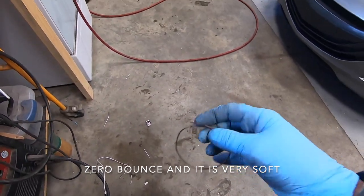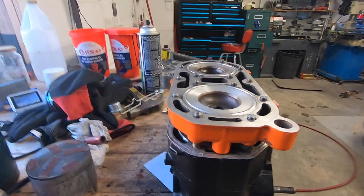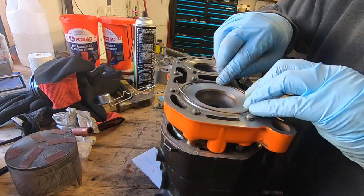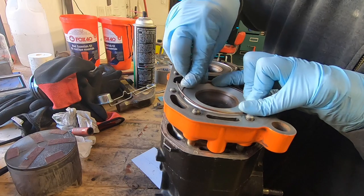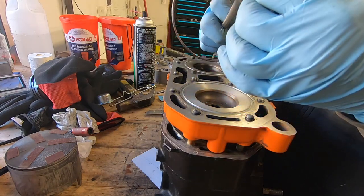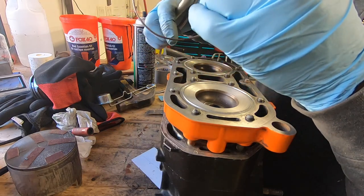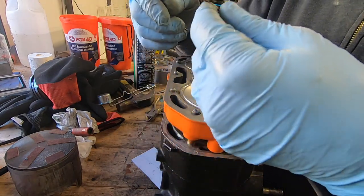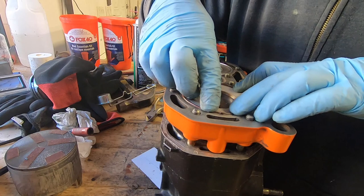I've let the copper cool down and dropped it on the floor — it has actually bent considerably. You can see the ends are way closer together. It's way more malleable now and it will be way easier to form to the shape. I can push it in place almost as though it were an o-ring. The one thing to keep in mind if you actually want to do this yourself is that copper does work harden. So after you bend it a few times, it will no longer be annealed — it will harden itself back up. You only get so many bends and corrections before the material returns to the stubborn form it was before.